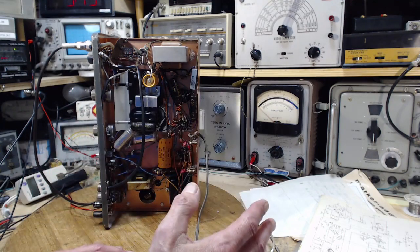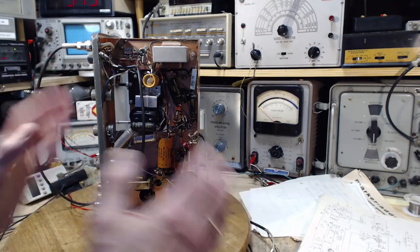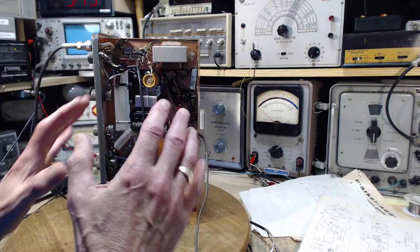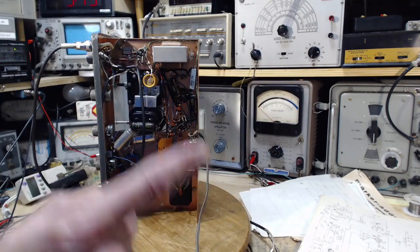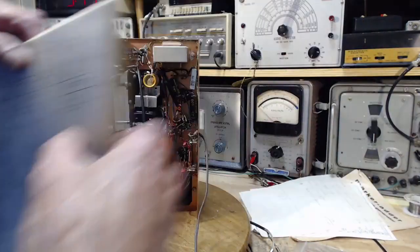And in the case of that one, the great big transformer actually overheated with no load. Exactly how that happens, I don't know. It has to do with currents maybe flowing in the tank walls. I don't really know exactly, but what a situation. That idea of DC flowing in the windings of an AC transformer is used in this apparatus, and that's why I told you that whole story.